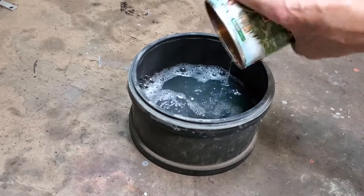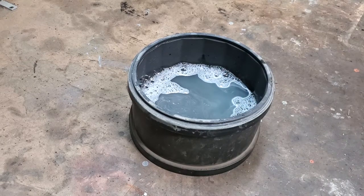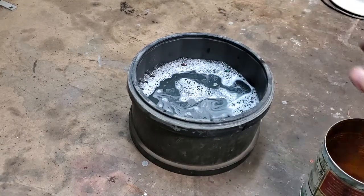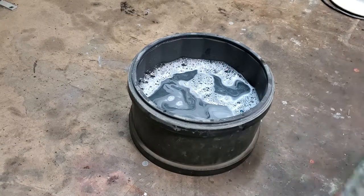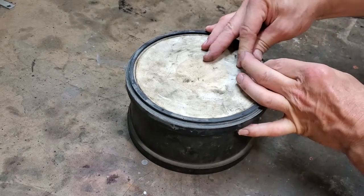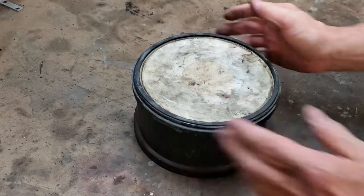Now we're going to add the water. It takes more time for me to explain this than it actually does to do it. I've got about one-third full — I'm going to add a little more water than that, then put the top on. Usually fill it so it's about half to two-thirds full with media — in this case, the rocks out of the driveway — plus the parts, soap, and water. Now I'm going to put the lid on. It fits into a little lip in the rubber, and I'll stretch a little band around. All set.